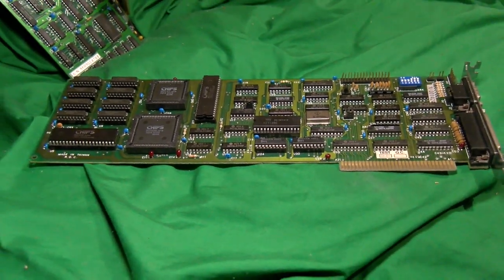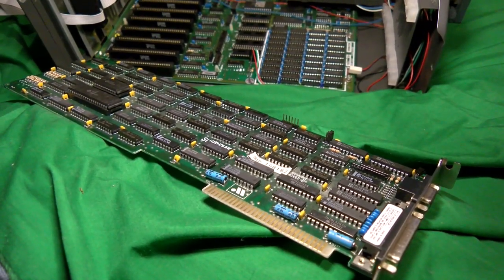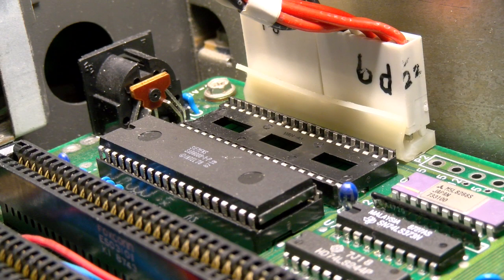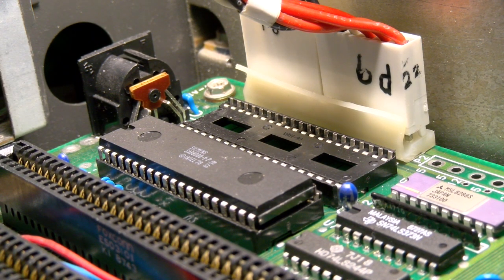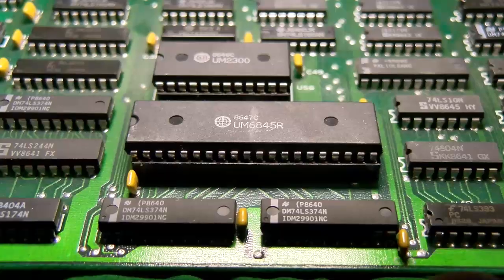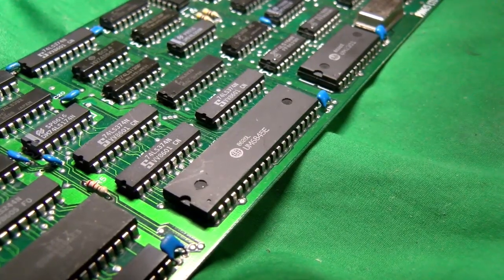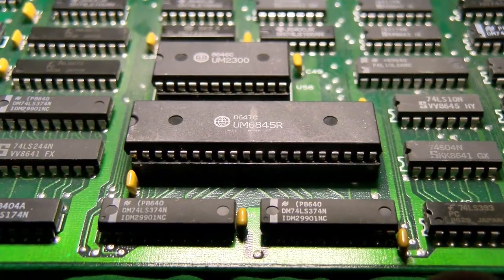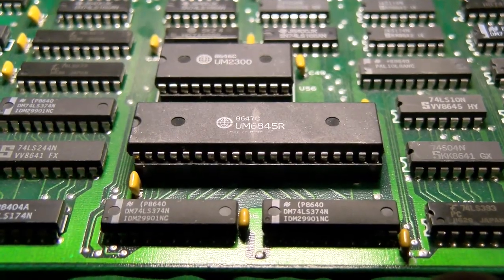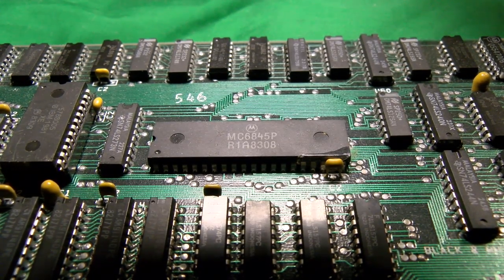The video system really is a bit of a thing with PCs, because it wasn't very pretty early on. And to be honest, it's kind of a strange thing. When you think back to those companion chips on the motherboard, the 8288s, the 8253s and whatever, the numbering at least suggests that they belong with an Intel CPU, and yet you'll notice on the CGA, MDA and HGCs, it has this other chip that's the CRT controller. It's a 6845. And it's a Motorola part, and 68 doesn't sound much like it belongs with an Intel CPU, because it doesn't. That's a Motorola part, as we said, belongs with a Motorola CPU. Yeah, it's a bit funky there, isn't it?